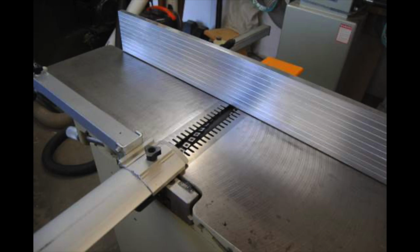Now, what gets you that feature that is flat is the fact that you have two sides that are off the same height of each other. So what you're going to do is you're going to run your workpiece up over the top of these blades, and on the trailing side, it's going to catch it at the thickness that you've adjusted. So if you're pulling 1/8 of an inch off, your trailing table is going to be 1/8 of an inch higher so that it can catch your workpiece on the far side. So basically, you can shave everything up to 1/8 inch off.